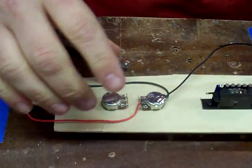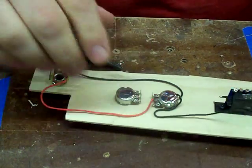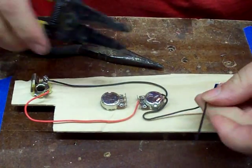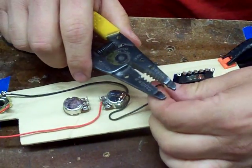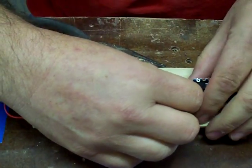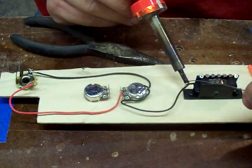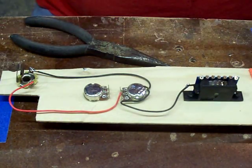When you do your soldering, one thing I had a hard time with and learned some time ago - your solder should look like it's wet, it should be shiny. If it's kind of hazy or it doesn't look wet, then you've probably moved it and it's a cold joint. You want to avoid that if at all possible. We're going to connect to the ground on our switch, and there we have our ground.